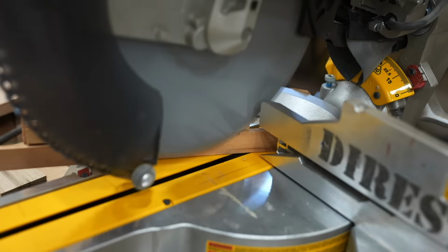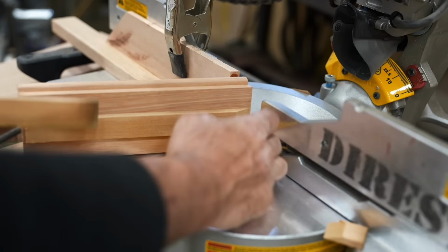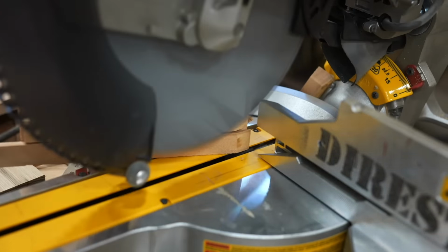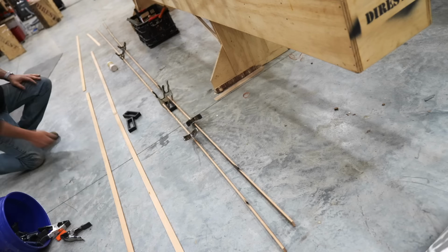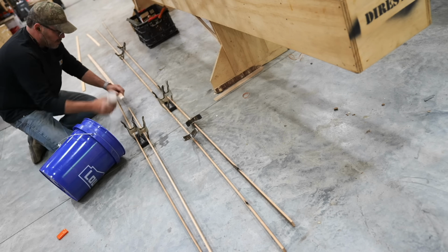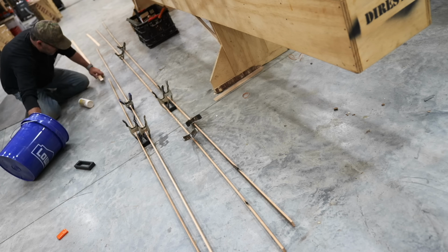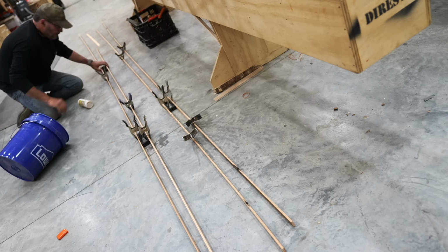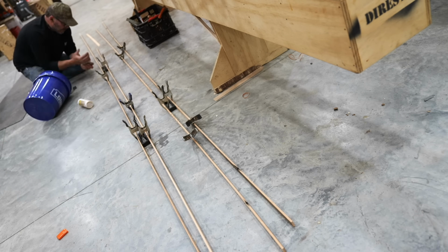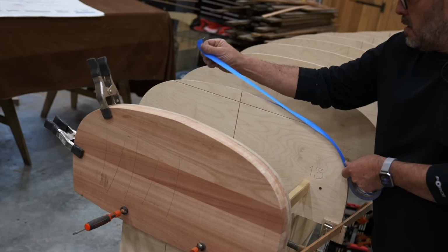And in some of the early planking, I glued up my scarf joints on the ground. So I would have myself a prepared 15-foot long strip. And here you see me doing that right now. And I use the weights from my strong hand table just to keep everything perpendicular while everything dried. Squeeze clamps. So I kept preparing long strips of wood over and over and over. I got to a point where I couldn't really bend. Sometimes the wood got to a point where it had to bend so severely that those scarf joints kept breaking.